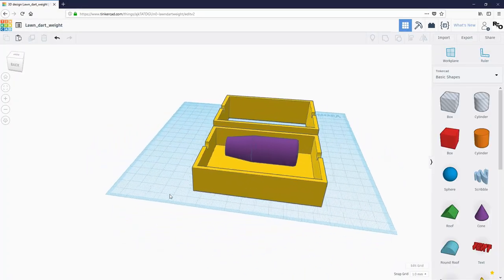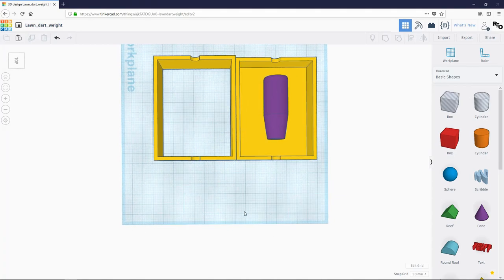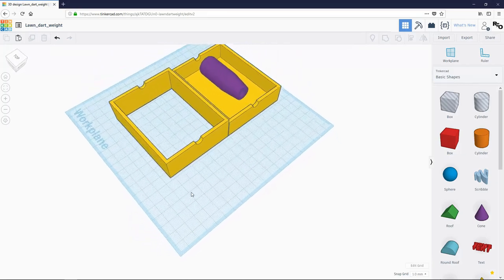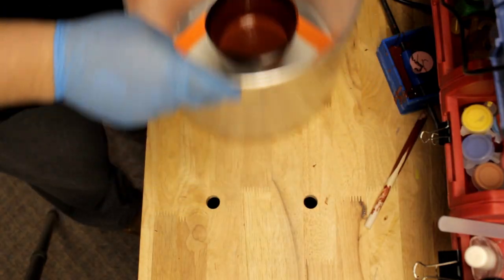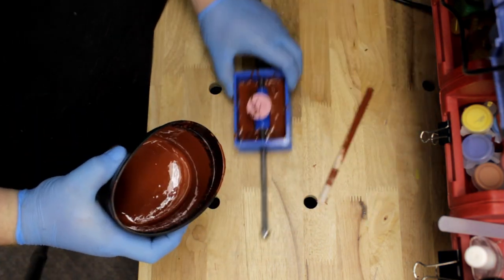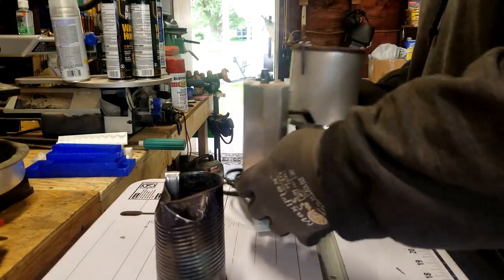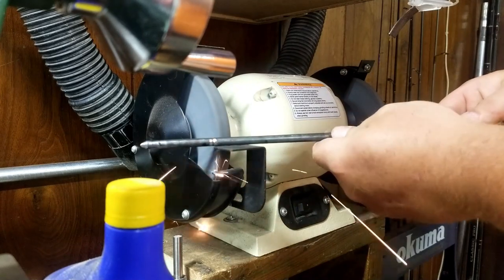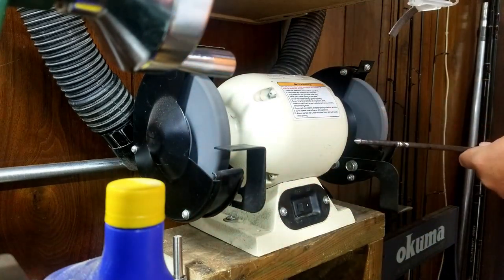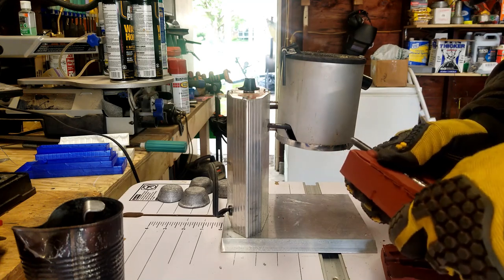The lead portion was a little bit harder to figure out. So what I did for the top nose cone lead portion is that's actual lead that I poured. I modeled it up in CAD, making reference to pictures I had found on the internet from the old jarts, and then I printed it out in PLA. I then molded a silicone two-part mold around that PLA positive buck form of it, and then I poured in molten lead with a Lee Pour Pot, with the 5/16ths mild steel dowel inside the mold already. Before I did that, I actually scraped out a little bit of the mild steel where the lead was going to be poured, so that way the lead would creep into those grinding marks on the steel shaft, and that would keep the lead nose cone stationary.